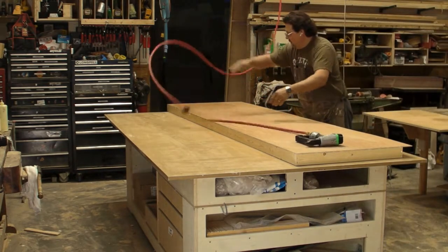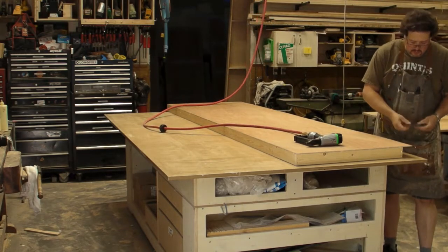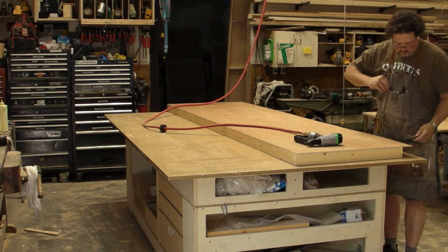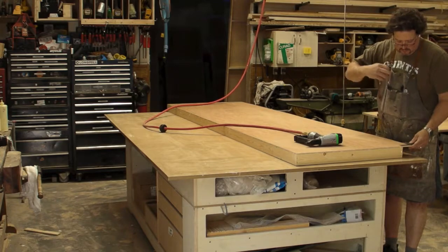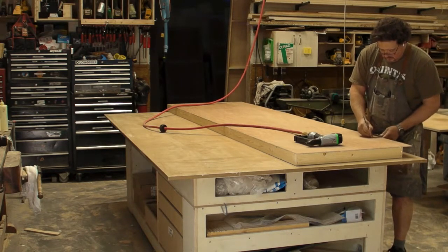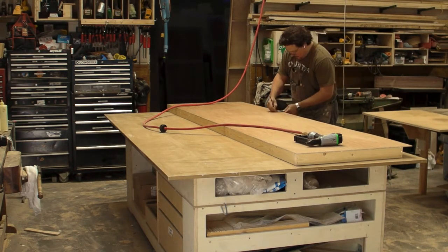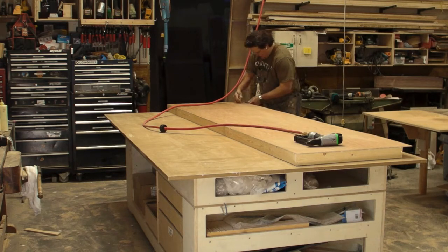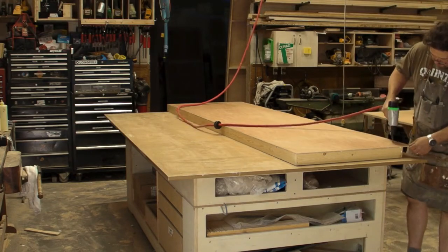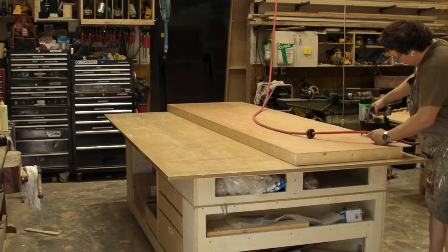I take my adjustable square and I figure out how much the pine is underhanging just by pushing the loose blade up against the edge of the pine or the rule, and then you just use the edge of the adjustable square itself and you slide along, and then you're able to give yourself a bit of a mark. It's a fairly typical carpentry trick there, and I've just marked the edge of the pine, so I go in about 3/8 of an inch all the way down.